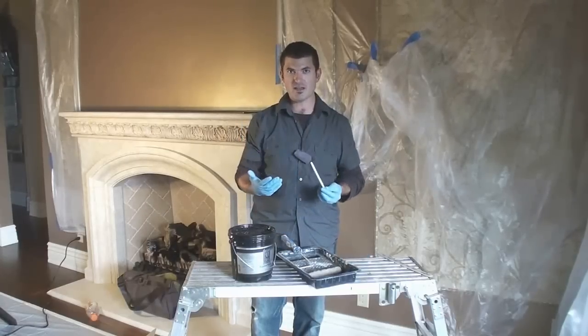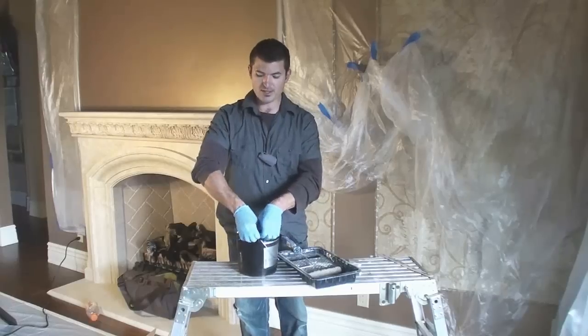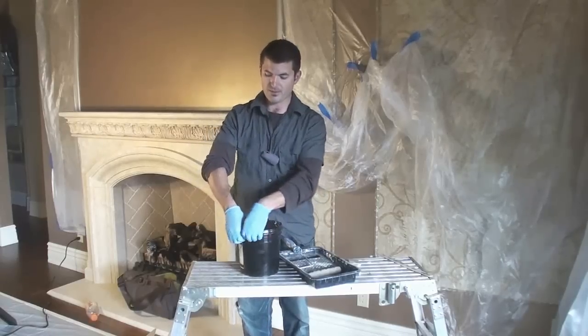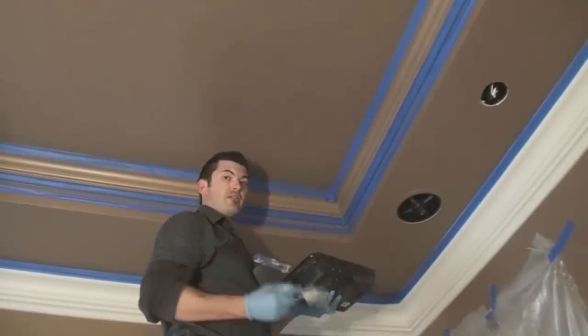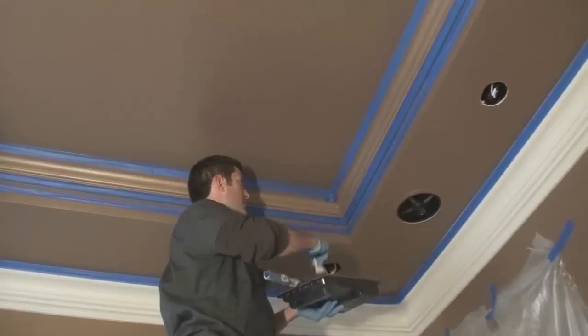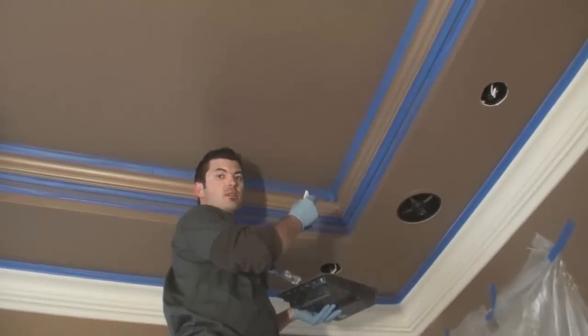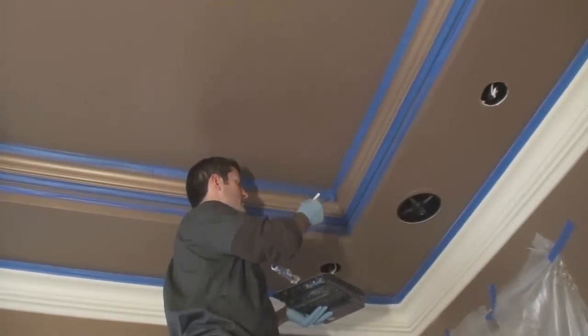This stuff — it is plaster, but it's a lot thinner than some of the heavyweight plasters, so you actually can roll it right out of the bucket. I've got my Luster Stone, I've got my chip brush, and all my tape has been sealed in with a clear Modern Masters dead flat varnish to avoid any bleeding under my trim.